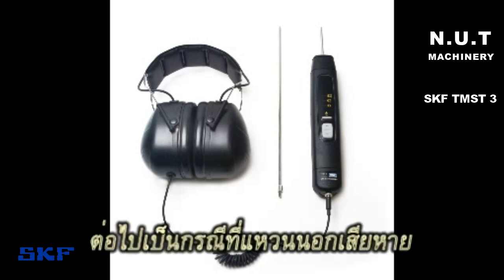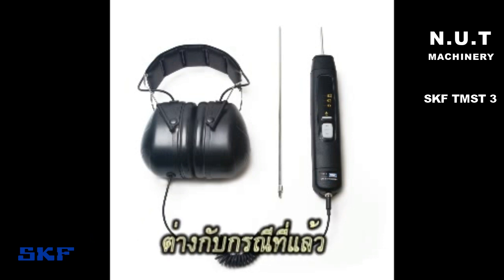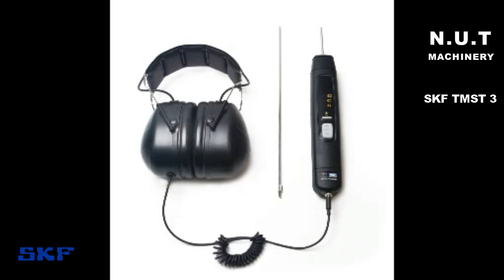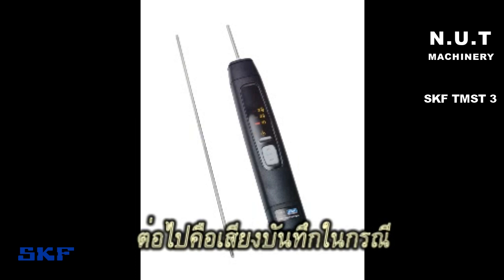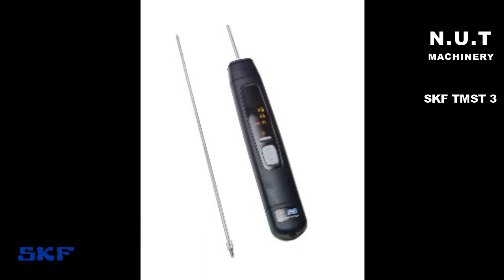Now it is the turn of a damaged outer ring, which is stationary and does not rotate like the preceding inner rings. The noise made by a damaged ball is more uneven and of lower frequency.